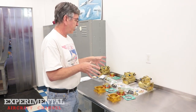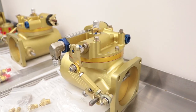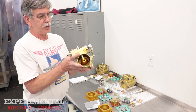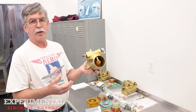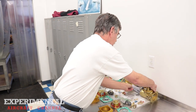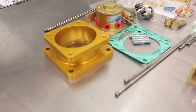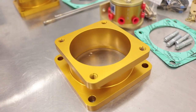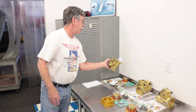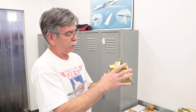Here are some kits that are ready to go to Lycoming for the Thunderbolt engines. This is an FM 200 fuel control — not lock wired yet — but this is for an engine that will make anywhere from 180 to 300 horsepower and we use this throttle body on it. Another different kit here is this FM 150, which is very similar to a Bendix RSA 5 fuel control.